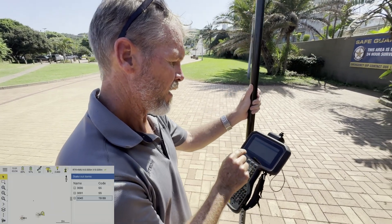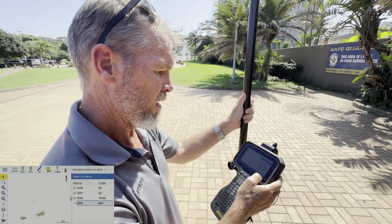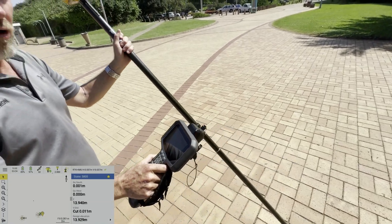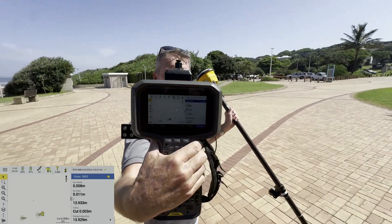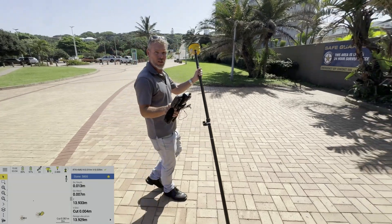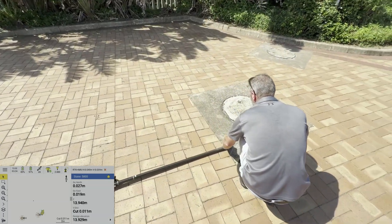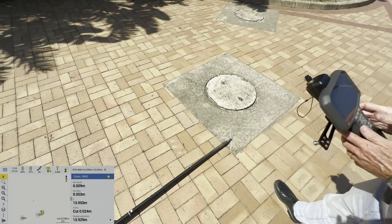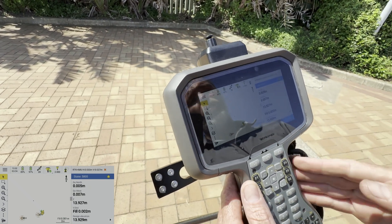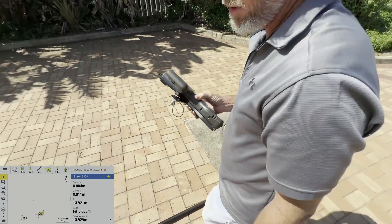Staking out benchmark one — the residuals are quite incredible. No matter how much I tilt the pole, you can really see the residuals are within millimeters. I can go in any direction and even lay the pole on the ground. We're literally getting eight millimeters, five millimeters — it's jumping around between 20 down to five, but that is an incredible ability of the pole tilt.